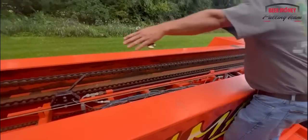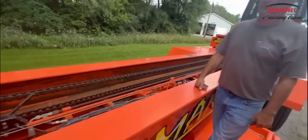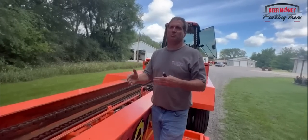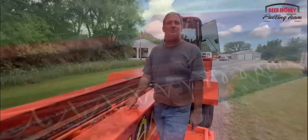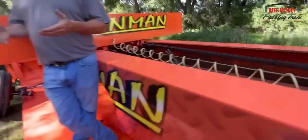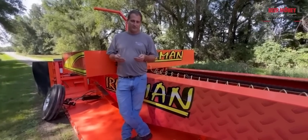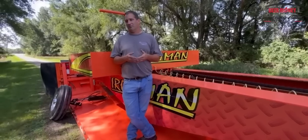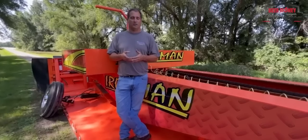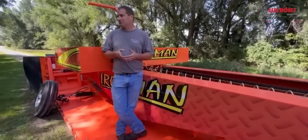So you have 6 feet to play with, and that switch there is basically for dialing in, the fine tuning of the sled change. Now, under this pan there's a specific pattern with what they call grouser bars. Everybody says they come out of the bottom of the pan. They do not. On our sleds, the grouser bars are bolted or welded to the bottom of the pan and are there all the time. There's nothing that comes out of the bottom of the pan.